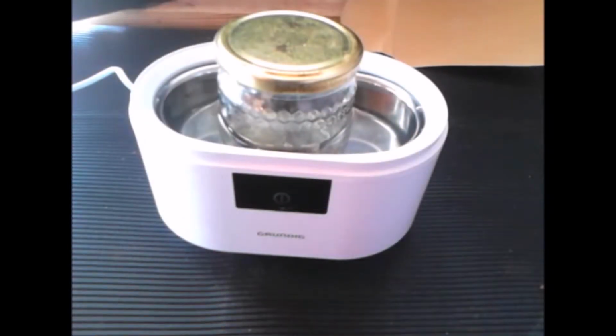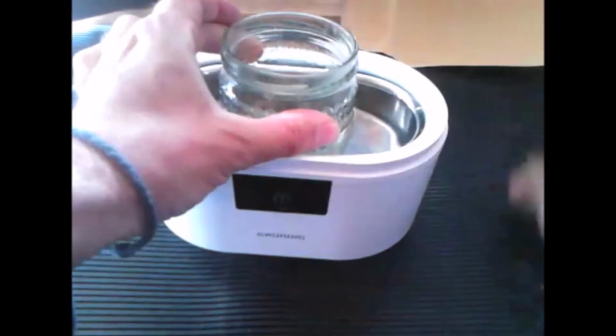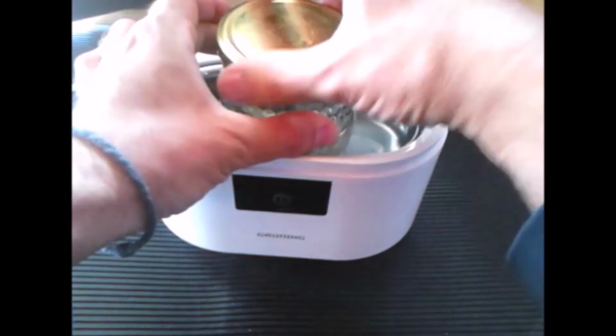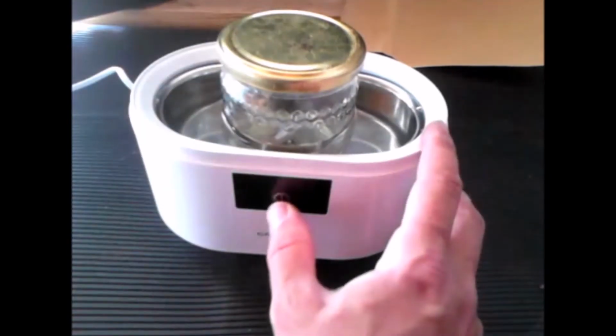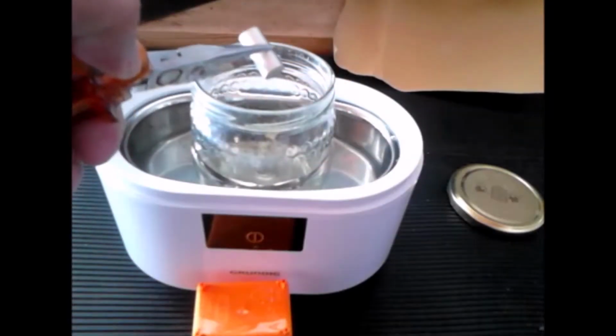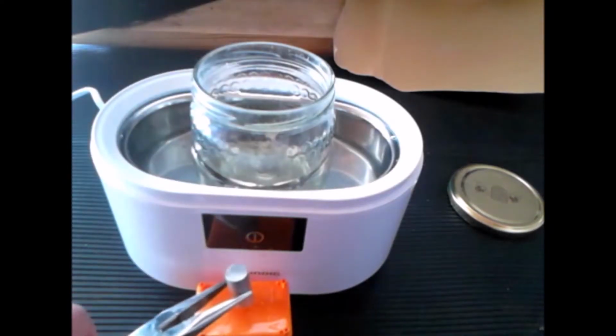After grinding, we clean the sample in a 50 watt ultrasonic bath for 5 minutes in acetone. So in the glass there is acetone, and 5 minutes cleaning. After the cleaning in the ultrasonic bath, we dry the sample in air.